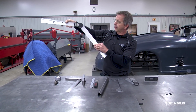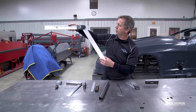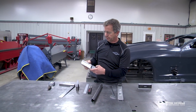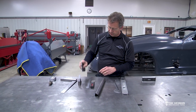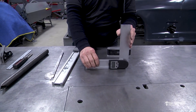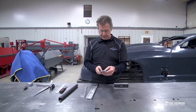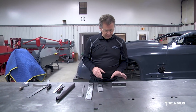We have several different sizes of these. The longer one is really good when you've got room — on a strut tube, main hoop, or something similar. The longer the arms, the more accurate it's going to be. This smaller one is exactly the same tool, just a shorter version made to get into tighter spaces. These are invaluable if you're working with a lot of tubing. They've also got magnets on each end, so when you fit it against a tube it sticks itself tight. Make sure metal burrs are cleaned off. They're excellent, very repeatable, with a nice zero function.